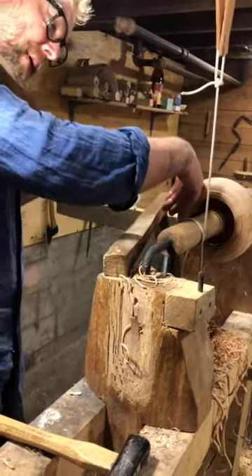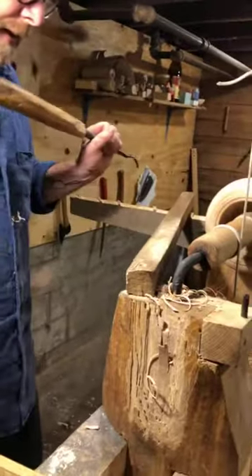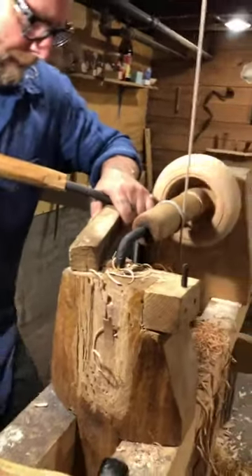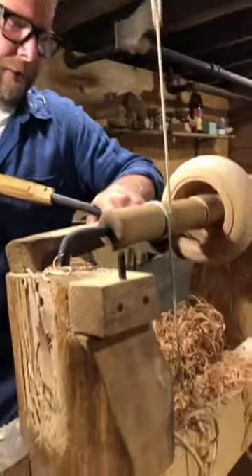The way the grain orientation relates to the shape you're turning, you want to go with the fibers. If you imagine this as a bowl with the bottom taken out, we're going to be hollowing from the widest point toward the base — and that's what I'm doing here. The trick with the reverse is that you can use nesting tools which you probably already have, and you're going to get a better skewing cut than if you tried to go forward with a hook wrapped all the way in.